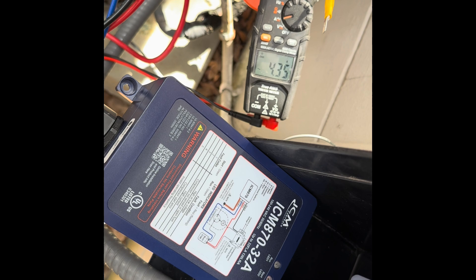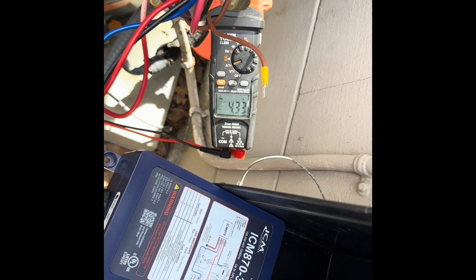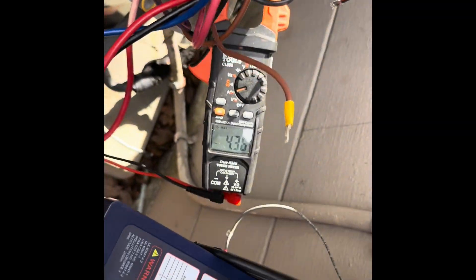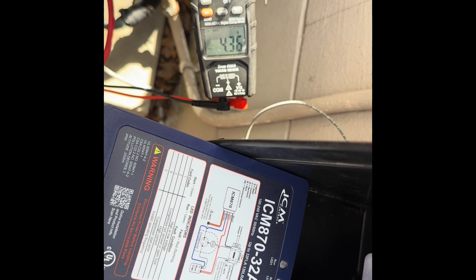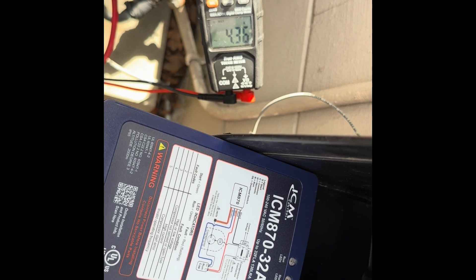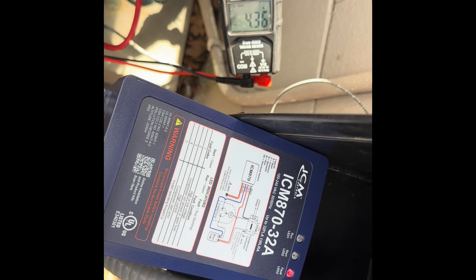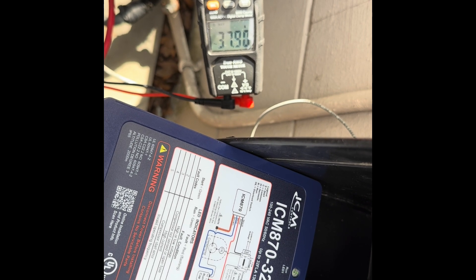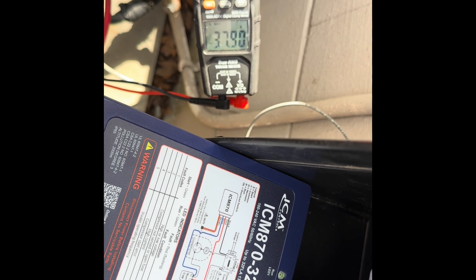You can just live with it, or you can add an on-delay timer and set it for three to four minutes. We're waiting for the four-minute timer — the fan is running and we're waiting for the compressor to kick on. This is normal; this is how this particular model is set up. I don't like that four-minute timer — I wish they would give you a toggle switch to turn the feature on or off. The startup inrush came in at 37.9 amps, and it drops down to about 12 amps running.